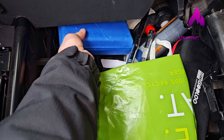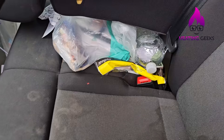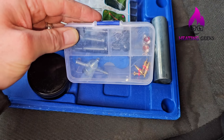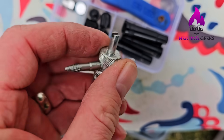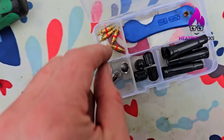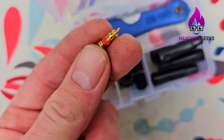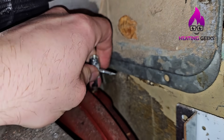If you've seen my video on puncture repair, you'll know I have this kit. In this kit there's the removal bit and my replacement cores. I'm going to unscrew the old core on the boiler and replace it with a new one. These are just standard Schrader valve cores that you'd get on a car tyre or a bicycle tyre.